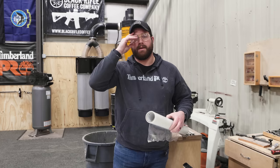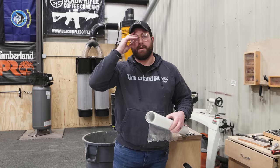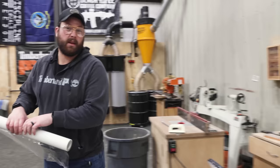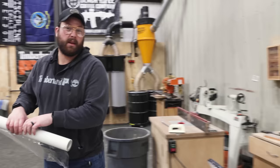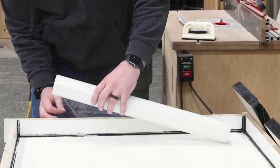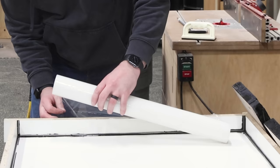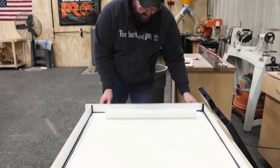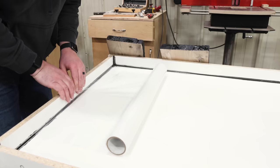So because we left this to sit overnight you get these little nibs on the bottom here. If you ever sit down at a bar somewhere and they've got an epoxy top, feel if they left these on there — most of the time they do and it drives me up a wall because it's the easiest thing to fix. We could satisfyingly pop them off, or a sander works just as easy. This is like a sticky carpet film that if you're working indoors you lay this stuff down so you don't ruin the floor. We a lot of the times use Tyvek tape for the inside of our molds so it doesn't heat up too much and melt the melamine. We're going to try this — it's more affordable than Tyvek and comes a lot wider.